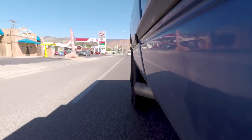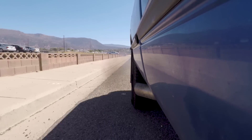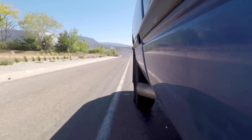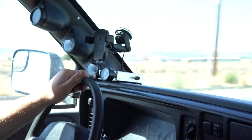The first thing we're going to demonstrate is smoke control in a city driving environment. For this test, I have the power knob set all the way up, so all the change we're seeing is just from the fuel rate adjustment. That's way too much smoke — that's not going to work. The smoke started occurring in the mid-range, so we're going to turn the fuel rate knob down.